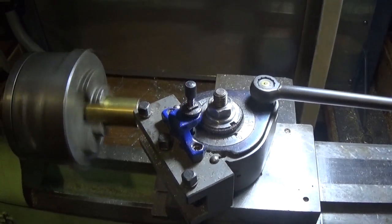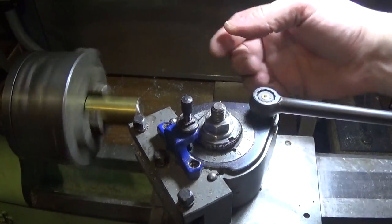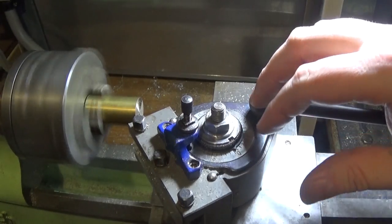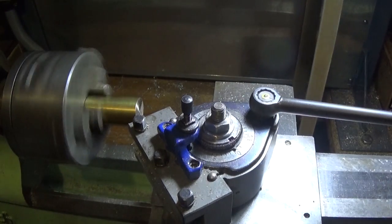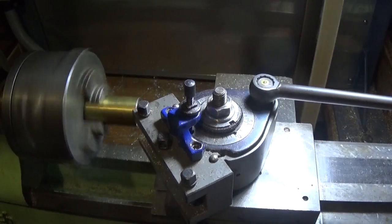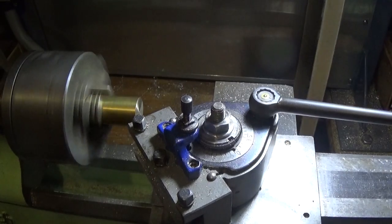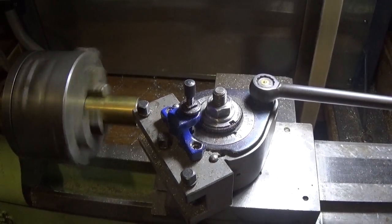There's been a few comments and I'll address them. While I'm facing this and getting it nice and square, I'm not pulling the tool back out of the job, because then I've got to work out every time how long or how much more to take off and reset this dial. So what I've done — it's only brass and it's a nice sharp tool — I just wound that back. It doesn't do anything for your surface finish at all.